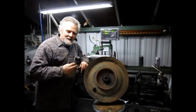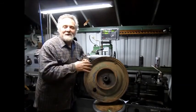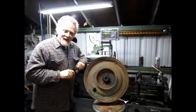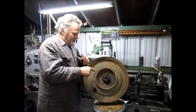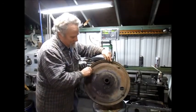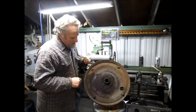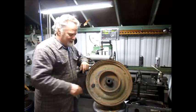Well, Nick Collier here again, and we've got a fairly interesting, turning brake drums, not that interesting, but it's a very interesting process because these brake drums come out of a 1934 Austin, and it turns out that the brake drums are literally riveted to the wheel rim. Now, it does come unbolted here, but this is where the tire goes right here. So there is no place that my customer could have gotten this cut.